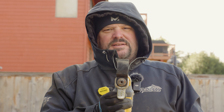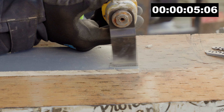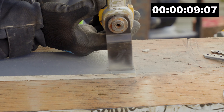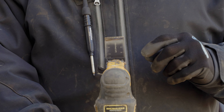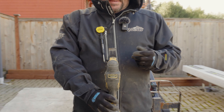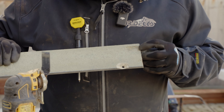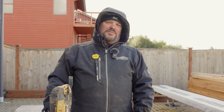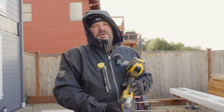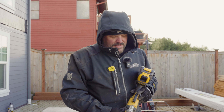Now I'm going to make my third cut with the same blade in the cement siding. Okay, you can see the bluing on the tip of the blade now — she's starting to get hot and dull. Usually when you get dull it starts to cause friction and then it starts to melt things together. We've gotten through three cuts and the first one was clean, the second one started to burn a little bit, and the third one's burning pretty good by the time I got through the back. For giggles, let's do one more fourth cut. I'm actually surprised it's done so well — it didn't seem to do as well when I was cutting a six-inch line versus just the width of the blade.